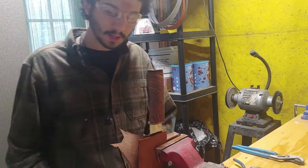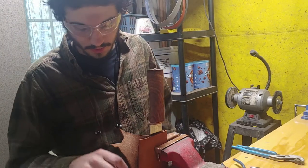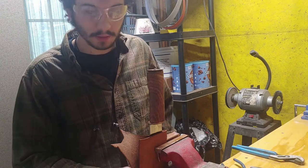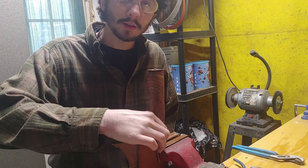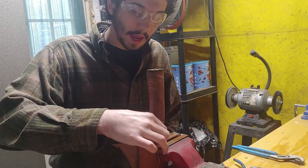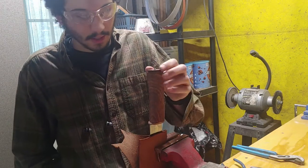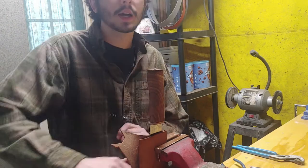From my research and talking with my mentor, I have a little setup here. I have a piece of wood block down at the bottom — that's to protect the tip of the blade. Then I have a piece of wet leather around the blade. There's WD-40 on the blade so don't worry about rusting, and then clamped in copper jaws. This blade should not be affected in terms of rattling around, and I cranked the snot out of this thing with the vise.